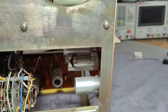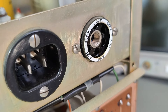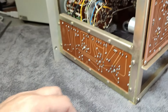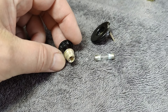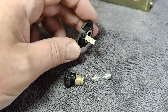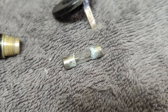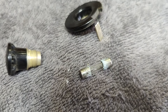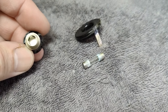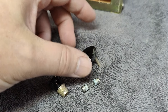The first little thing that I found is a classic voltage selector and fuse combined. You unscrew the fuse and then you can change the voltage — I want it for 240 volts. Those fuses just corrode like that, creating all sorts of unstable contacts. So I have to replace the fuse and then I can start my first power up.